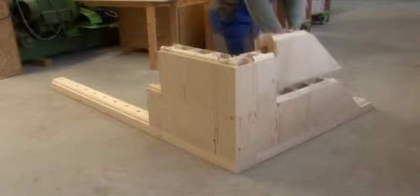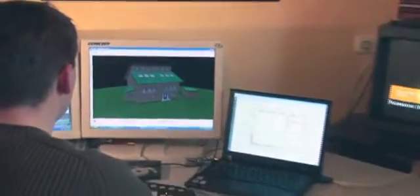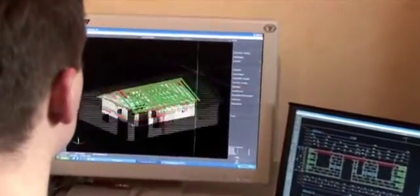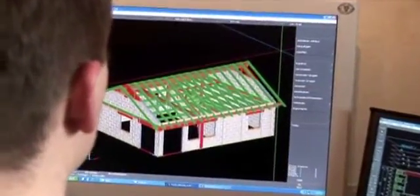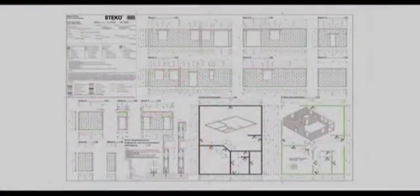Using a planning program, we prepare the floor plan, sectional views, and sectional drawings of the building to be constructed, and coordinate and confirm this with the building owner. The construction plans for assembly are drawn up using a CAD program such as AutoCAD, CADWorks, etc. Every wall, every module, and every special module are recognizable in the plan by way of a labeling or enumeration system. Designed for both construction firms as well as for the do-it-yourself builder, the construction plan is a set of simple and easy-to-understand instructions on how to set up the walls.